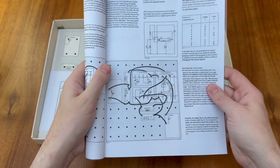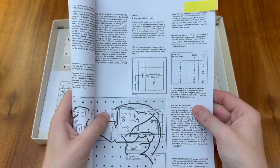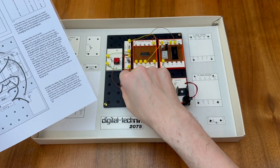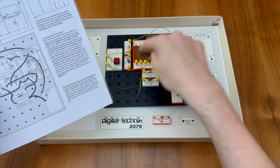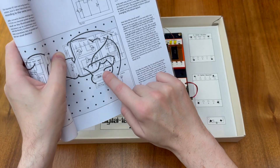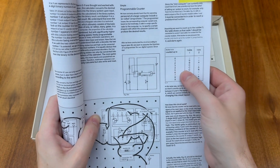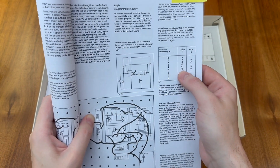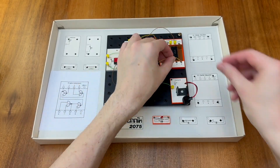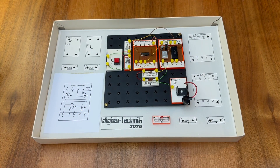So hopefully we've connected up the circuit correctly, but to actually program our programmable counter we need to choose where to connect our two flying cables. That's this lead here which is connected to pin 7 on the gate module — that's wire 2 — and we have wire 1 here which is connected to the resistor. If we want to count up to 5 we have to connect cable 1 to output C and cable 2 to output B. So let's connect the power and see what happens.